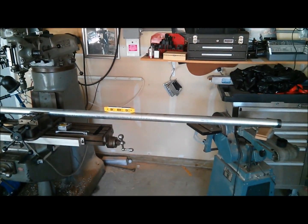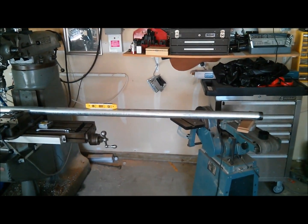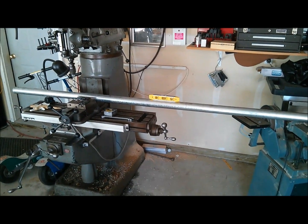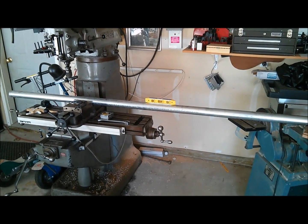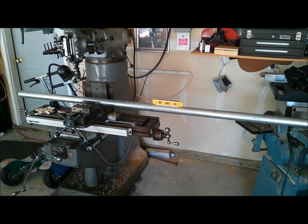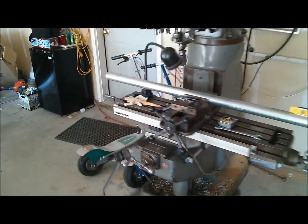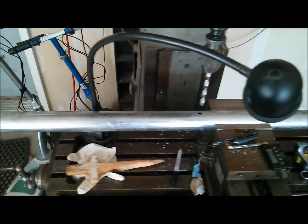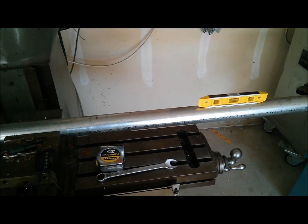Here is the beginning of the solar tilting ground mount project. It's a piece of 2-inch galvanized schedule 40 pipe that I bought at Home Depot. They only have 10-footers so they cut it to 8 foot for me. Now I'm poking a couple of half-inch holes into it — one hole will be 2 inches from the end, the next hole at 24 inches, and the third hole at 36 inches.